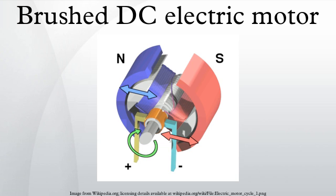If the shaft of a DC motor is turned by an external force, the motor will act like a generator and produce an electromotive force. During normal operation, the spinning of the motor produces a voltage, known as the counter EMF or back EMF, because it opposes the applied voltage on the motor. The back EMF is the reason that the motor when free running does not appear to have the same low electrical resistance as the wire contained in its winding. This is the same EMF that is produced when the motor is used as a generator. Therefore, the total voltage drop across a motor consists of the CEMF voltage drop, and the parasitic voltage drop resulting from the internal resistance of the armature's windings.